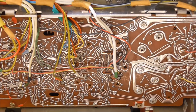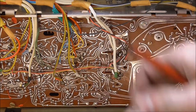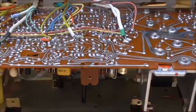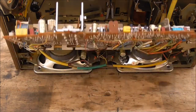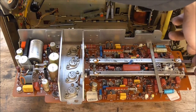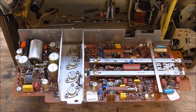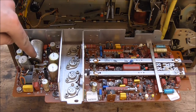It's fascinating to see, and maybe we can get a look at the components. Someone has been in here because the red paint is already broken. Apart from that rubber wheel, this thing is really well engineered — who thinks about such a design? Here are all the transistors that basically do the amplification. These are the switches for record and normal play, so they switch around the electronics to remove tone or to play tone onto it. And this right here is the AC to DC converter section with all the filters and the fuses in there.